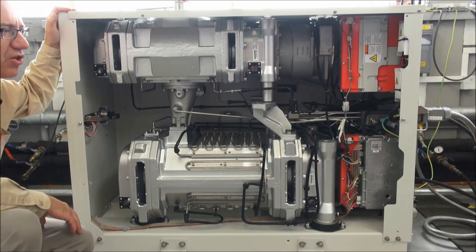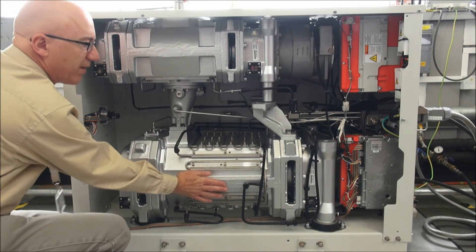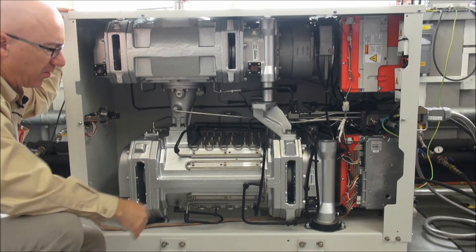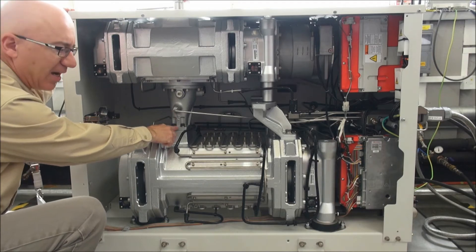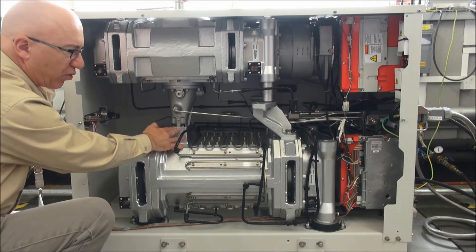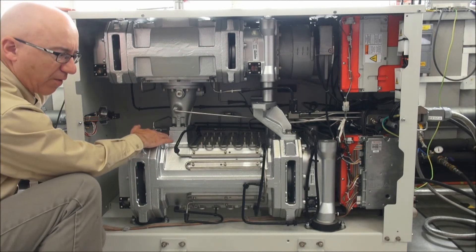The GXS industrial dry vacuum pump we have here is a combination pump where you can see clearly we have the dry primary screw vacuum pump here and in this case a combination with a roots mechanical booster. This is the screw pump. The inlet to the screw pump mechanism is through its inlet port here. There is a spool piece which connects it to the outlet of the booster, and the outlet of the dry screw pump is underneath at the back at the low vacuum end. This is the low vacuum end and this is the high vacuum end of the dry screw pump.